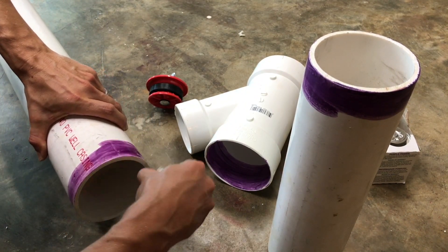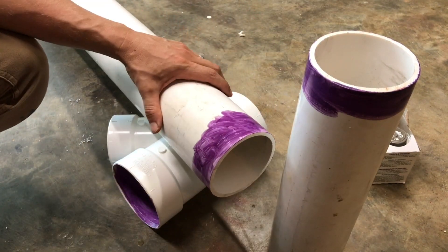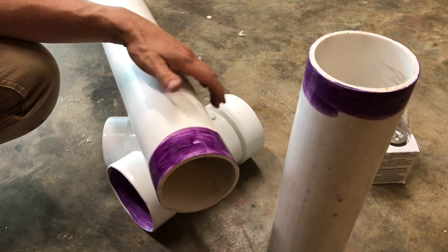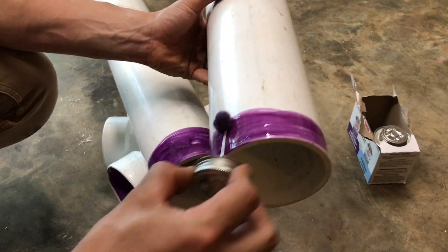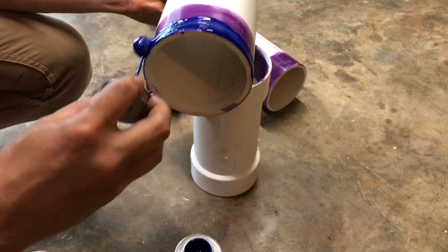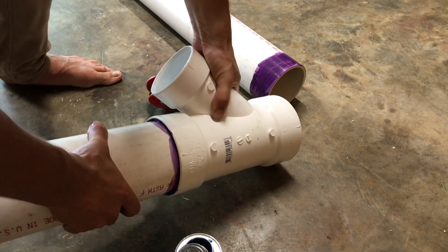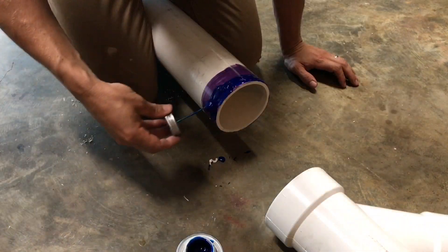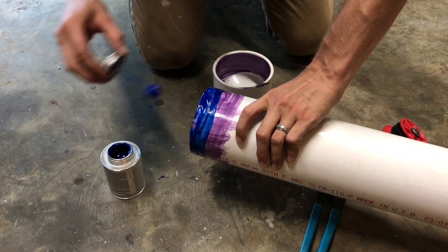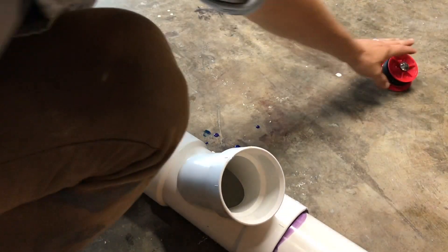Once you get all your joints primed and cleaned real good, make sure you get all the sand, debris, or particulates off — it's good to keep them up off the ground. When you're gluing pipe this big together, it's important you have a good first run because once PVC glue dries, you're done and locked in, and it dries very quickly. Be very generous with the glue — it serves as both a sealant and a cement. When you slide it in, always give it a little twist of about half an inch to an inch, which creates a slight threading effect for a better seal. This matters especially when dealing with pressurized water and air.